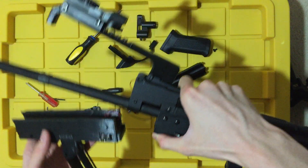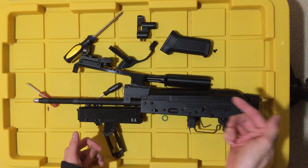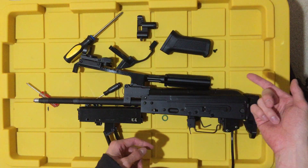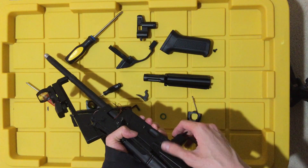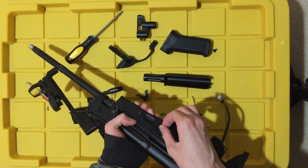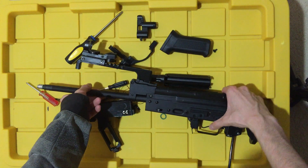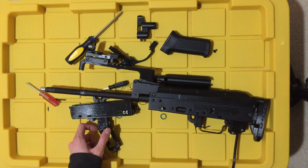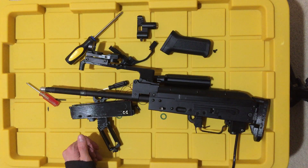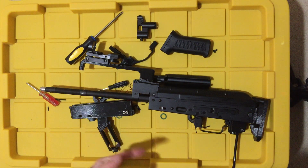I think that's going to be it for this video. I'll have a circuit breakdown for how you can wire this up, since mine is hardwired to these switches. There are two ways you can do it: you can use the original, or if you have an AK style trigger board, you can keep the selector components and that will allow you to use the safety from this. The full auto and semi-auto selector will still work, but the mechanical safety will not. So just make sure you wire in an additional safety like I did. I'll have a more detailed description in the circuit portion. Thank you for watching — any links for materials and the files to make this yourself will be in the description.